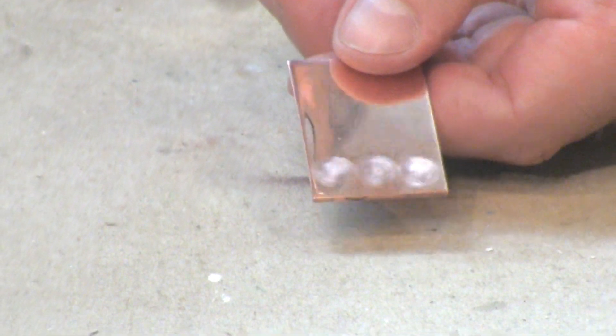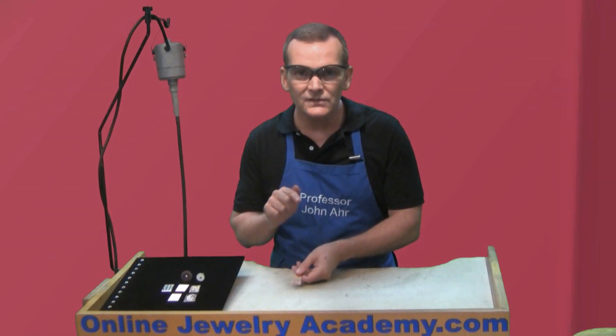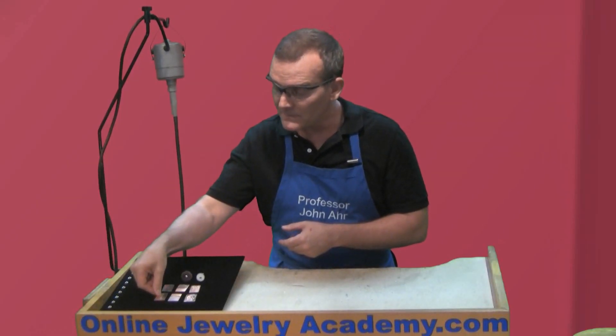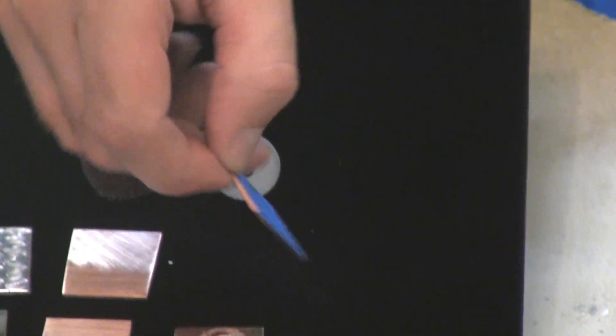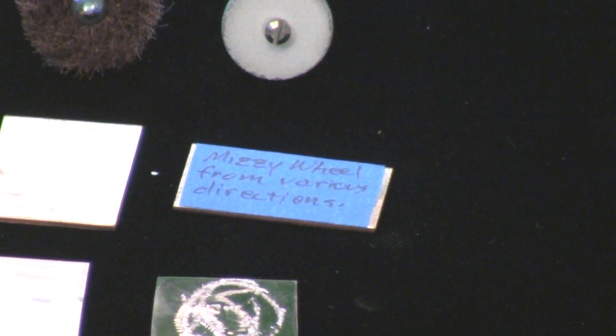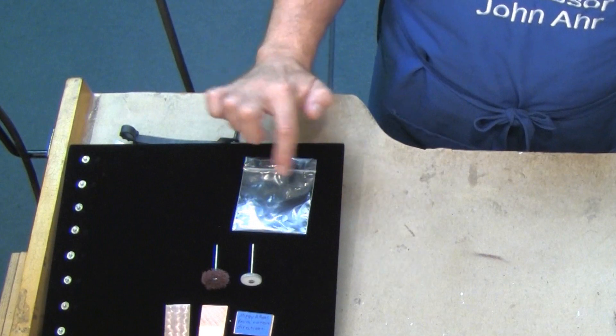I just made three little circular shapes on the bottom of this piece. When you do this, you're going to have to really pay attention and hold your tool steady as you grind across your surface. You don't need to leave spaces — you can overlap. These types of surfaces are very popular in contemporary sculpture and jewelry design. One thing I'd highly recommend after you're done working is to apply a piece of tape to the back of your sample and record what type of tool you used to create that finish. And another tip: store your samples in individual little plastic bags so you don't damage them, and they're always at the ready if you want to show them to a client when recommending an interesting surface finish for their piece.